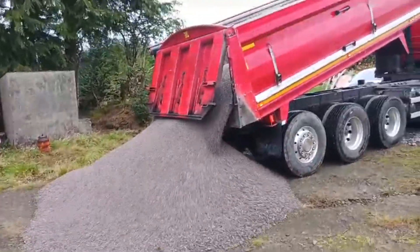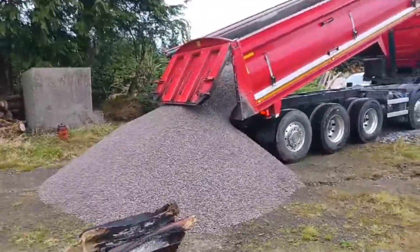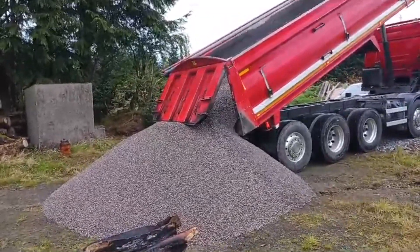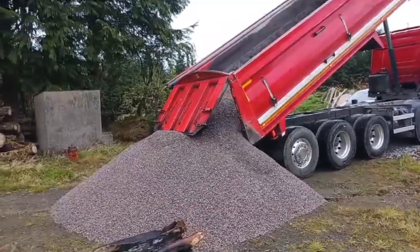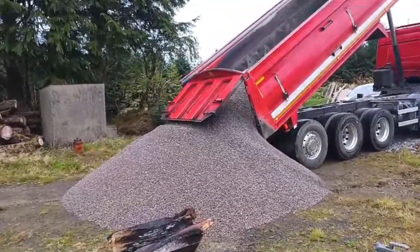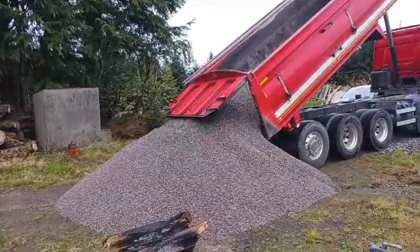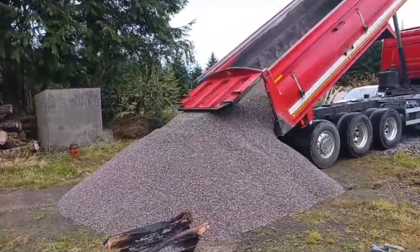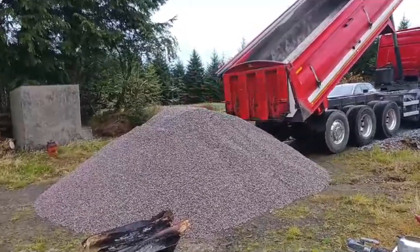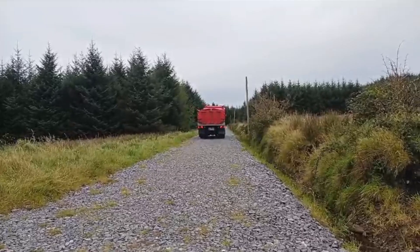Just to be clear, this whole polishing filter that we're talking about isn't the septic tank. So when the waste and sewage comes out of the house, it firstly goes along pipes to the septic tank, and then the septic tank sends it to this place where it's all really cleaned. It's a finalised cleansing of any liquid that comes out of the septic tank. I think it's 90% pure by the time it comes out of the tank, and by the time it goes into the filter it brings it up to — they say you can drink it — but at the very least it's 97% pure water. We'd have our own water cycle, darling, if we'd just put a tap at the other end.